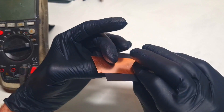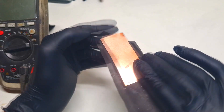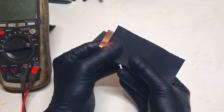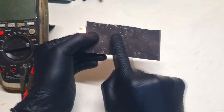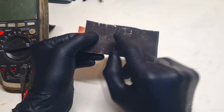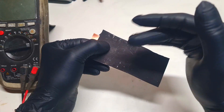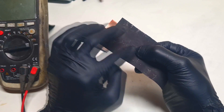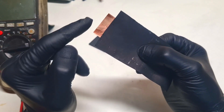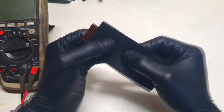The setup for making this kind of current collector is like this: you put this conductive HDPE on this copper foil. In this case, the conductive HDPE surface will have direct contact to the active material and to the electrolyte of the battery, and the HDPE will protect the copper, while the copper will support the conductive HDPE with conductivity.